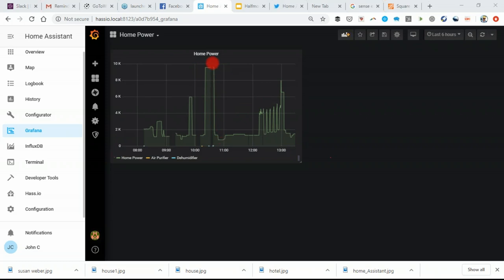There's nothing you can do about a 4 kilowatt water heater. When it turns on, it's going to use 4 kilowatts of power. So all you can do is take whatever base load is on at the same time. This is actually a 10 kilowatt heating element within my air conditioning system. Whenever that 10 kilowatt heating element turns on, there's nothing I can do about it, but through reducing my base load, I can take about 1.5 kilowatts offline during that time.